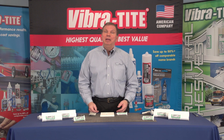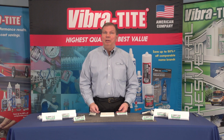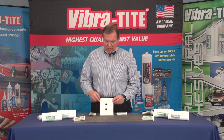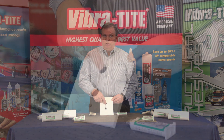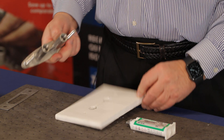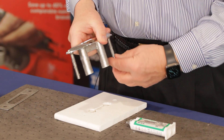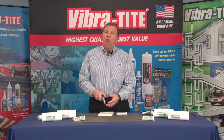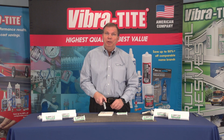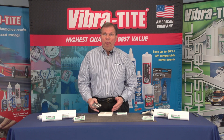What we're going to demonstrate today is how to correctly attach a cleat to a fiberglass boat. After the boat is assembled, you'll have a template and you'll cut away the shape of the cleat. Now the cleat only has two screws. If you attach it and just put the screws on, all you're going to have is all the stress where those two nuts are, and any kind of a strong pull will easily pull through the fiberglass.